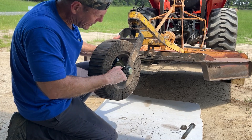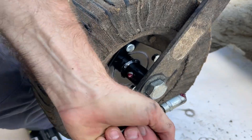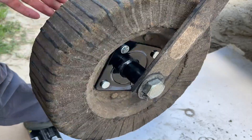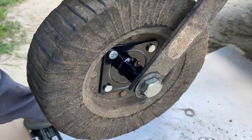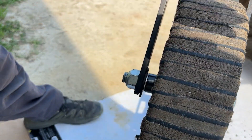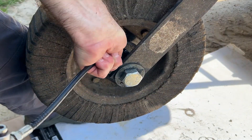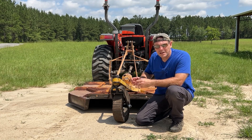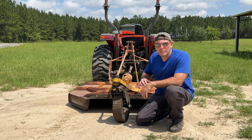The last step is to fill it full of grease — you want to fill it until you see grease come out on both sides. That's 15 pumps of grease. Go ahead and turn it to see if we can get more in there — 12 more, then 12 more, and I still don't see any grease coming out. I'm looking for grease to come out right there. It took about 30 pumps of grease to get it to come out on the sides where that bushing is, but now she's fully lubed and we've removed all that slop by putting that new hub on there.